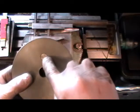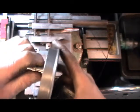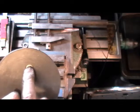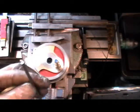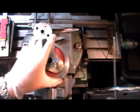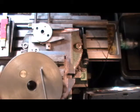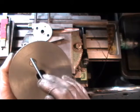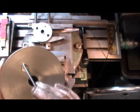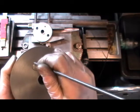I've got to pin the back of the crank pin into the wheel, just to belt and brace it so there's no chance of it ever slipping. I've got to put a 5/32" pin in. Now because my wheels are cast iron and because the crank pin is hard 316 stainless, obviously if I try to drill halfway in there the drill is going to wander off and favour the softer material, and it's probably going to end up drilling nowhere where I want it to drill into the cast iron.